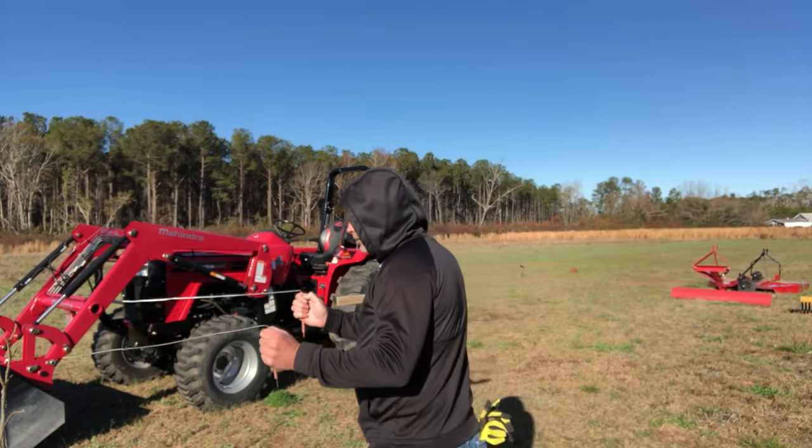All right, so we're going to have a part two. It'll happen tomorrow. It's starting to get dark now. It's starting to get cold again. While we were way behind the pipe and things we needed to buy, the sediment kind of washed back into the bottom of the hole. So we're going to have to re-auger that in the morning, take out about 15 foot of that new water sand silt so that we can get the casing down as far as I'd like to go.